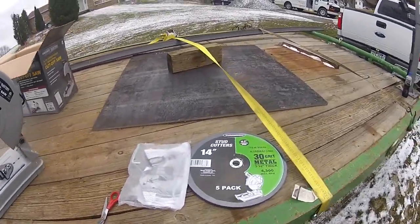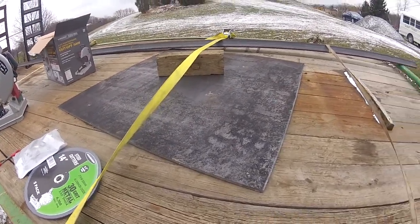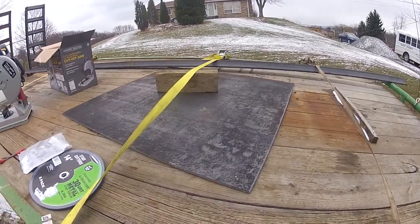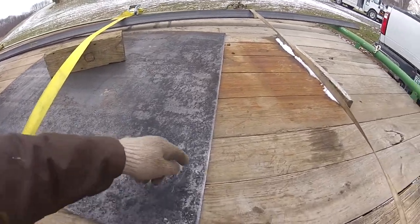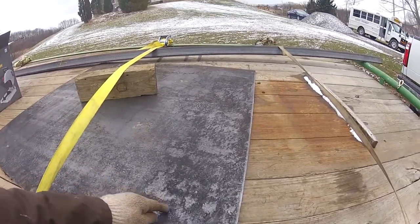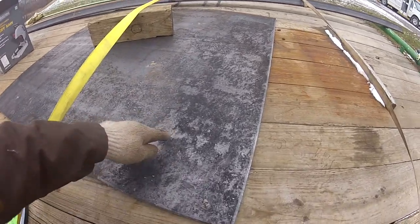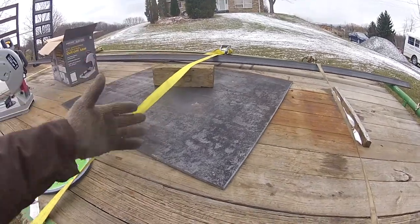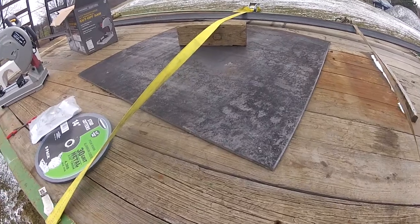So we'll get her put together here, and I got a bunch of steel angle, and I got a 1/2-inch steel plate. I'm building a welding table. I'm going to put 4 legs on it, 36 inches long, so it comes about at my waist. Then I'm going to move in 6 inches and put 4 angles just to stiffen the plate. And then inside of that, I'm going to draw on a 6-inch grid. I'm going to drill 1/2-inch holes every 6 inches the whole way through so I can bolt stuff down, anchor stuff, and things of that sort. And if I need a bigger hole, I'll drill a bigger hole where I need it.